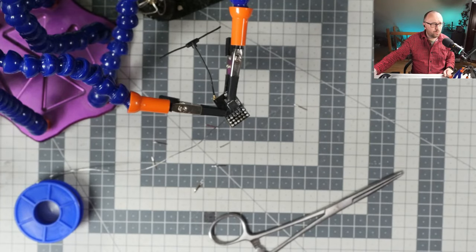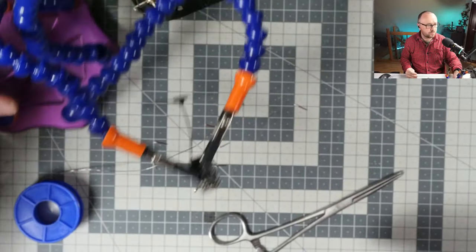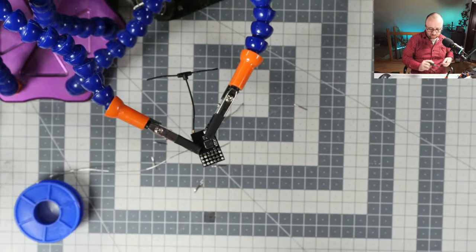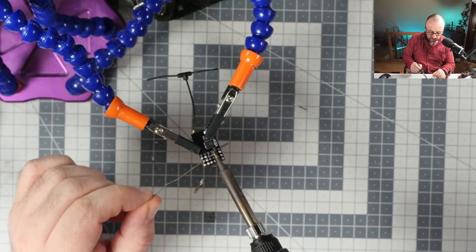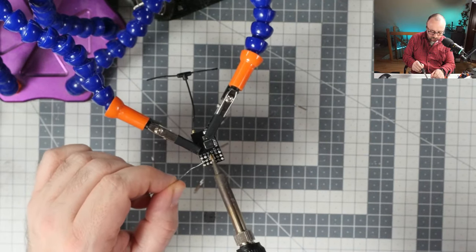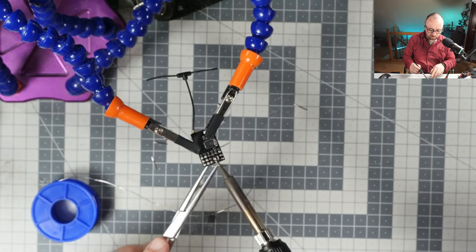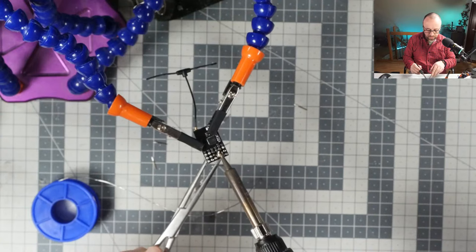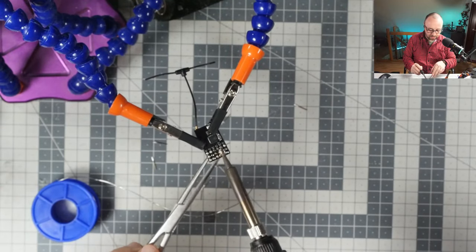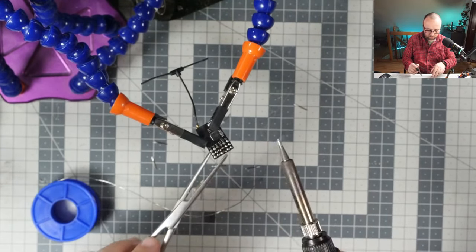Peter, I have a problem with the heat gun. I do own a heat gun, but personally I hate using it because I have no sense of for how long I should apply the heat. Every time I tried doing this with the heat gun, it ended up frying the PCB. So I'm usually extremely cautious, and only use the heat gun when I want to remove something huge that is not that delicate, like, for example, the SMA connector. But if I have a choice, then no heat gun for me.